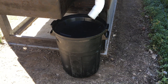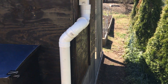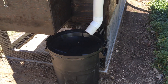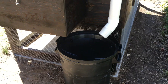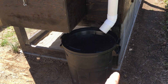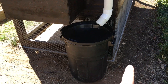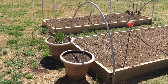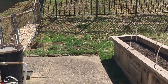There's the rain collection barrel underneath the chicken coop. As you can see, the gutter's mounted, and I just used some Schedule 20 thin-wall S&D pipe — I use this pipe all day long for work so I have a bunch of it with fittings — and it basically just dumps right into the rain barrel. It's super easy to just lift up the lid and go in with your watering can to water down the garden beds. What I normally do, and I'll do on this one as well, is put an overflow just where the bottom of the lid is level with the trash can. I'll add an overflow, but I'm not sure yet whether to run it into the pachysandra or into a second collection bucket. I'll show you on my other one what I typically do — it's just a few PVC fittings.